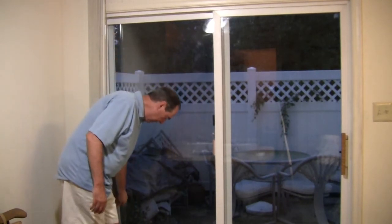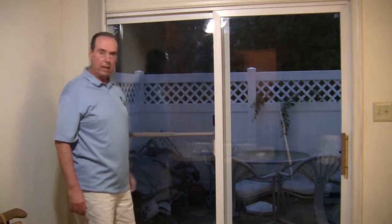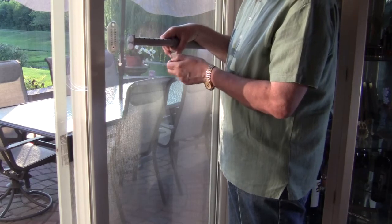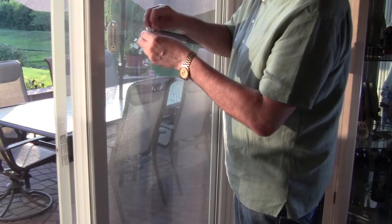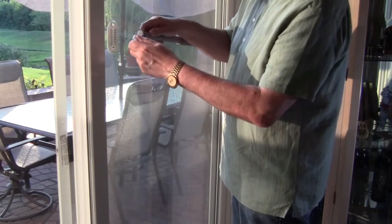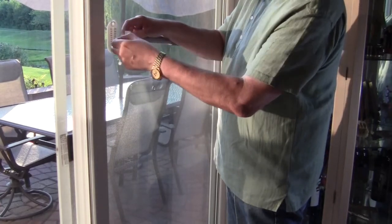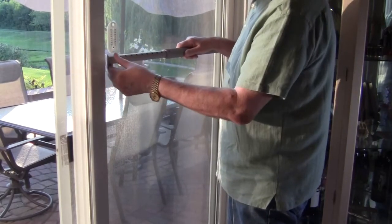When you want to lock the door, just lift up the lock, drop it back into the catch cup, give it a couple of twists — it's locked in place and can't be lifted out. It's just that simple. In this case, the door has a recess in the back and won't work right without using a shim. The door lock comes with a shim that you apply to the pressure-sensitive Velcro on the catch cup, extending it far enough into the recess so that when you peel away the liner on the shim, it fits nicely inside the recess.